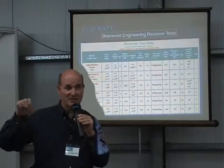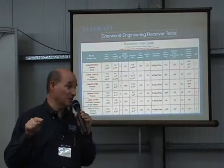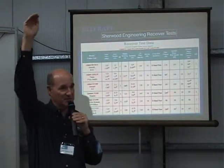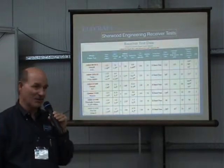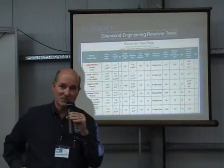Especially if you're testing, I can in the same test lab bring the same radio in 2 weeks apart and get 1 or 2 dB difference in the numbers, because you're looking at things down to the noise floor when you're comparing the strength of these signals that cause the interference. You're always referencing that to your noise floor, and that can vary a little bit by a dB or so. It's very tough to get exactly the same number every day, plus or minus a dB. So I don't worry about it.